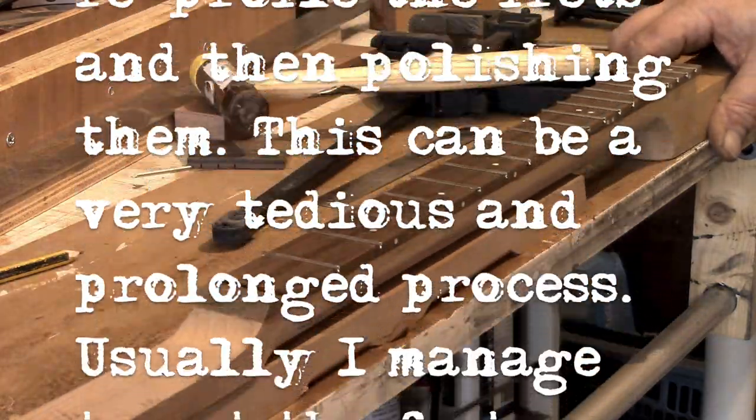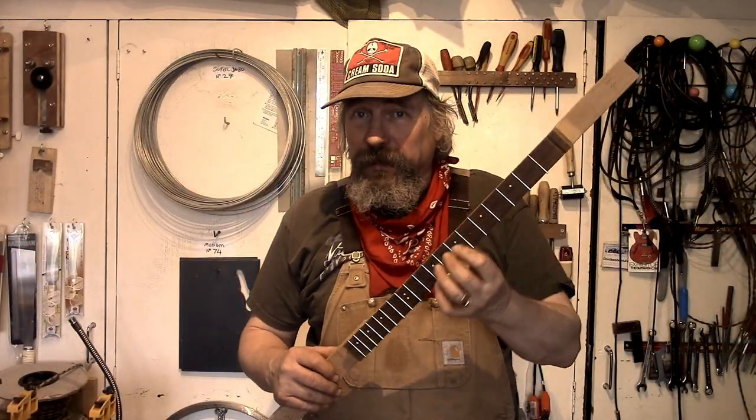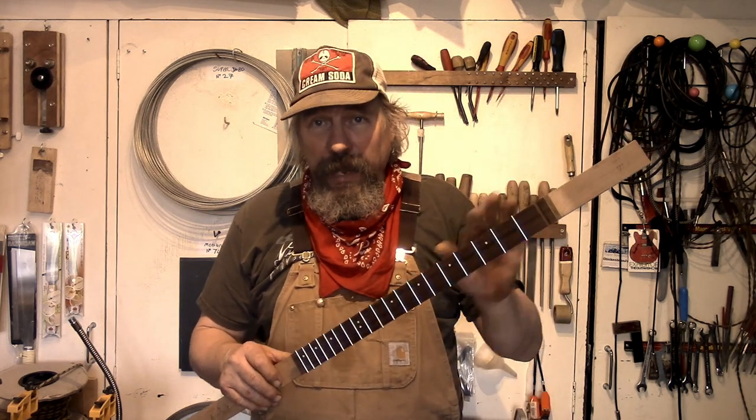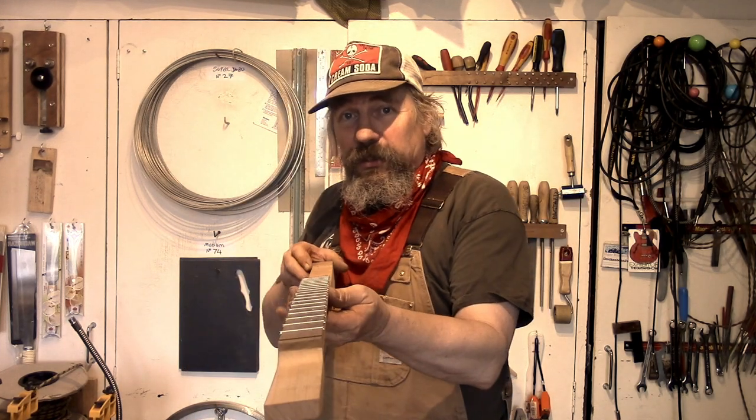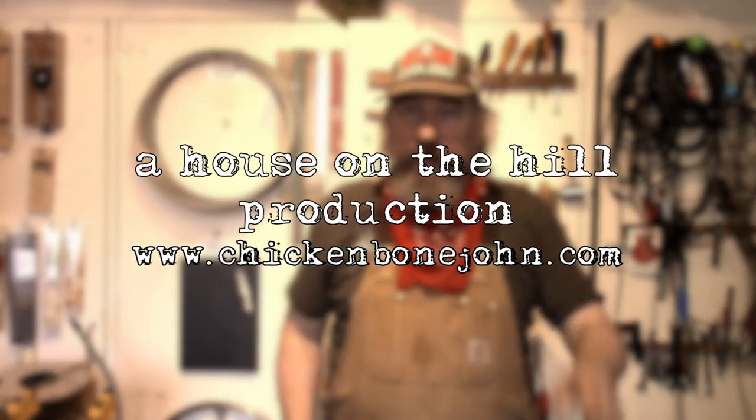So that's it — we've put all our frets in and leveled them. The next step will be to trim these edges off; we'll do that in the next lesson using all hand tools. Remember: level the neck, check it for straightness, check to make sure it's not twisted, then put the frets in. You don't need that many tools — just a soft-faced hammer, a fret rocker for checking for high spots, and a good pair of end cutters. Next step we'll be dressing these fret ends, getting them nice and smooth so the neck is comfortable and plays accurately. See you next time.